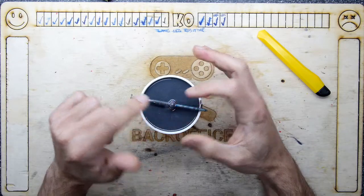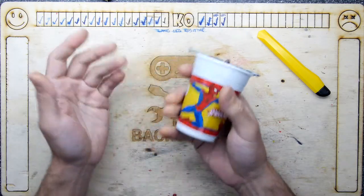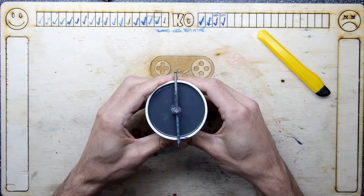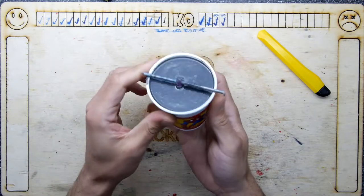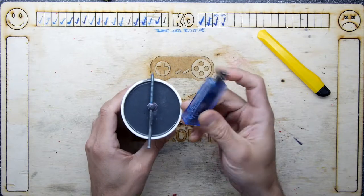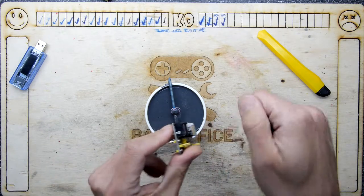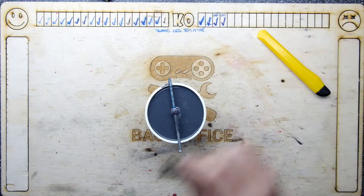I've made the object and poured the silicone, and I fully intended to make a video on the whole process, but I wanted to learn it first. So today I'll show you the results of that first stage, and hopefully we might even do some resin casting. The idea is: I've made an object, encased it in silicone, and I'll be able to pour resin around a PCB so it comes out as a block — a very cheap enclosure for prototypes.